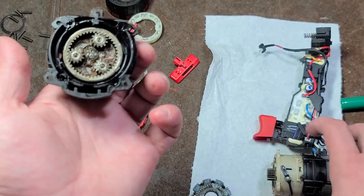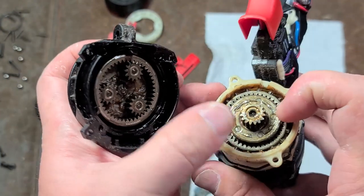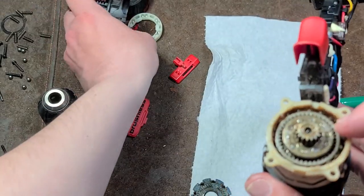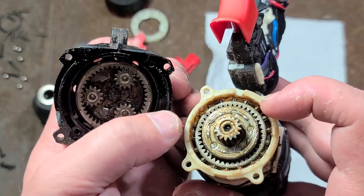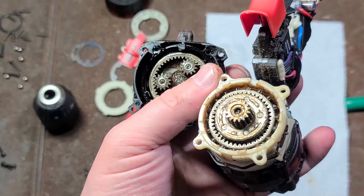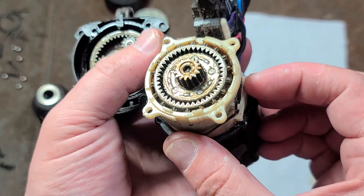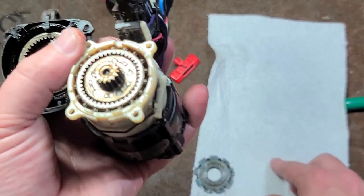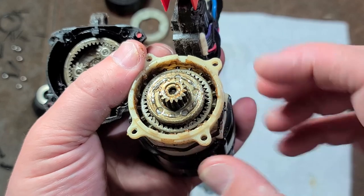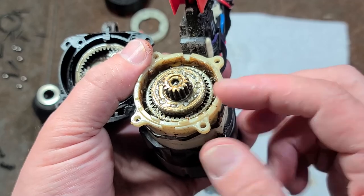This piece is press fit. I think I'll try getting this apart — it has this extra little plastic thing. No idea what it's for because it has no seal in it; maybe just to help reduce particles getting inside. This bearing right here is actually held in by another snap ring. I'll put this in a socket and give it a few whacks — this was barely held on there, just had to give it a light tap and it just popped right off. Then we have our bearing and a little steel washer down there.